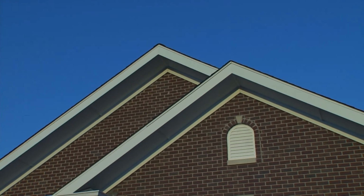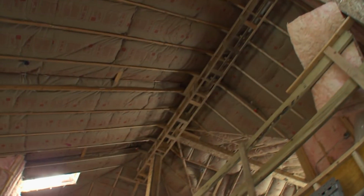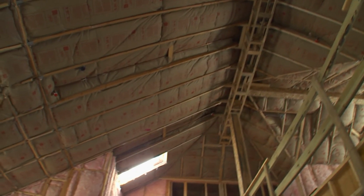Okay. So based on that, bringing all this together, the assembly of the roof becomes basically you have your framing, sheathing, and then is it the same steps and elements there, water barrier, vapor barriers? Depending on, let's take a house roof, right? I think everybody can relate to a residential roof. So usually what happens at that point is the insulation goes across the ceiling joists, right? And you have an air control layer at that point.